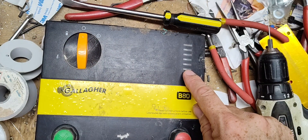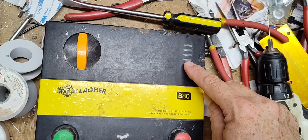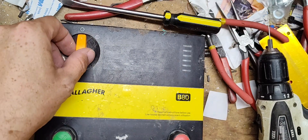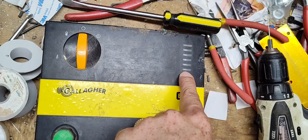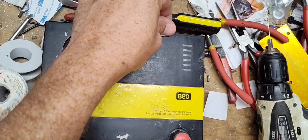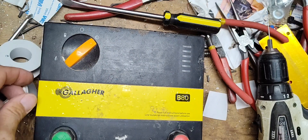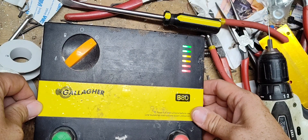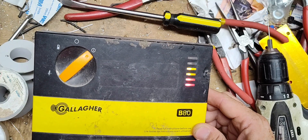Let's hope those are working. Before, when you'd turn it on, it would click and flash but only show the bottom red light. There should be like two red, two yellow, and three green lights or something like that — and that's all it would do. I put a new board in and everything went to work fine, lights flashing all the way up. There it goes — just a new capacitor and away we went.